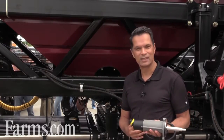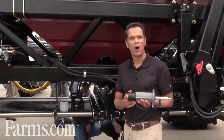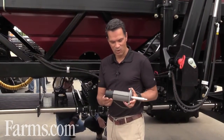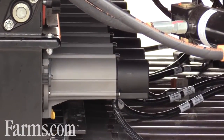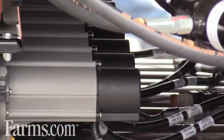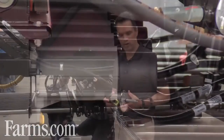The first one is the motor itself. It's a substantially bigger motor than we've had on our Icon systems for the last two years. It's about a 40-watt motor compared to a 10-watt motor. And this motor actually sits outside the meter housing. So you can see, if you look back here, that entire motor and gearbox is sitting outside of the meter housing, which will address the issues that we had with contamination and startup from last spring.